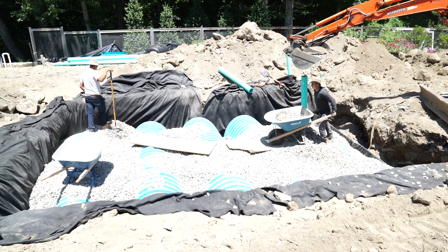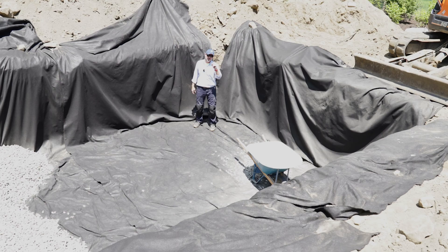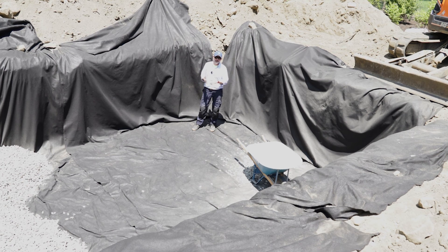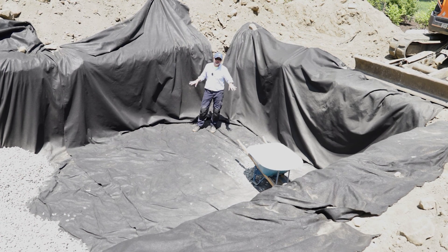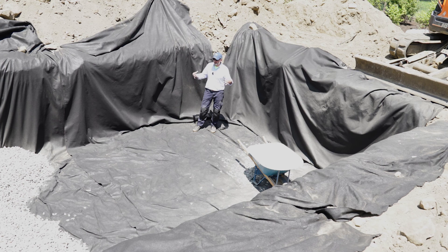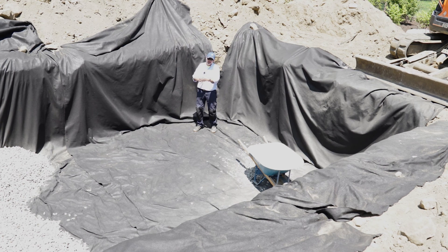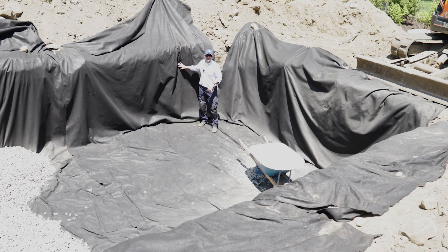The other critical element on a system is non-woven geotextile fabric. What is that? Basically, it's a very heavy-duty filter fabric — very robust and thick — and that allows us to keep debris out, keep dirt out, keep the drainage stone clean. It also helps keep tree roots and any kind of rootage that's drawing towards the water source out of our trench. We don't want them in here. We don't want them gnarling up and knotting up inside of our chambers. Clean and pristine. So this filter fabric is critical.